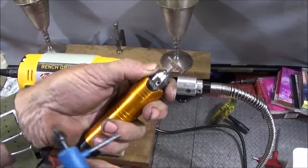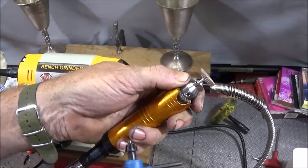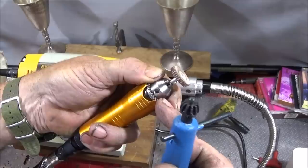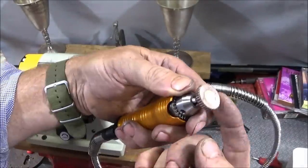And this actual flexi shaft comes with this nice handled key. You have to use it in this U part on the actual handle of the drill. Otherwise the teeth of the key clash with the end of the actual housing there. And with this one you can actually tighten that up nice and tight. This is a really good tool here.